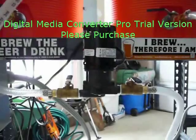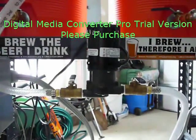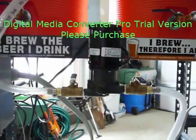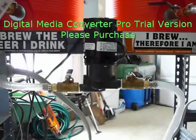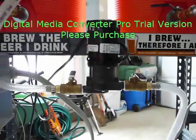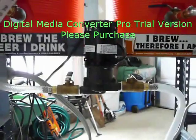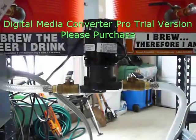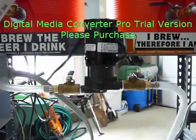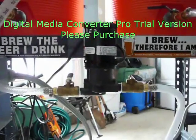The orientation here is a little unconventional. Most people set these up so they're mounted horizontally instead of vertically. I did have mine mounted that way at one time. Again, I also had 3/8 inch plumbing on the rig at that time as well, and it was nearly impossible to get the pump primed, and the flow rate was abysmal. Right now I probably get about 3 to 4 gallons per minute flow rate.